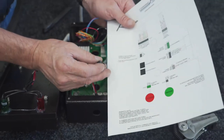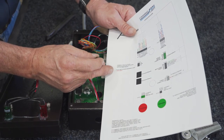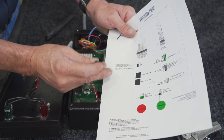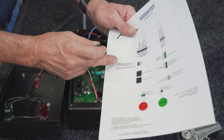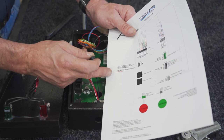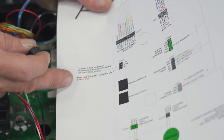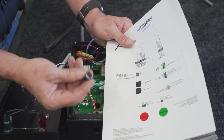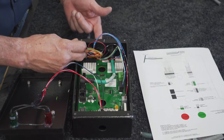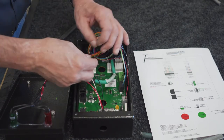So on the lower port of that, you will bring your control wire back to your elevated warning device. Then the second one, the middle port on this connector, will be whatever your elevated warning system is looking for. So if you want a positive to come back out on your signal wire, you'll put a positive in here. It's the same with a negative. A negative in here will give you a negative out whenever this tower is elevated. Once you get those hooked up, you can just go ahead and repin that one. There is a port both at the top and the bottom for you to bring in your power, your ground, and your signal wires.